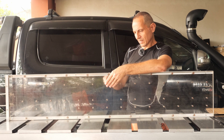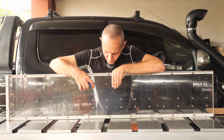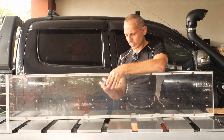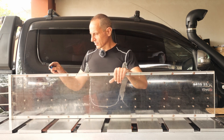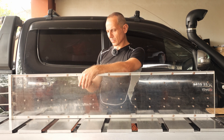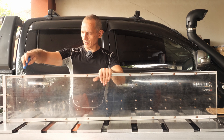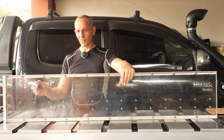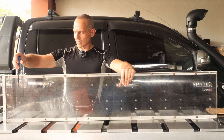I have the allen key here and I can turn the grab screw so it protrudes from the stainless steel insert. The sled is 19 millimeters and I used 12 millimeter grab screws, which allows me to raise each individual leveling grab screw to around nine millimeters maximum. If that's not enough I can resort to shims. The stainless steel makes the whole thing waterproof and time-proof. It also gives me the possibility to attach other jigs or attachments using this matrix of threaded holes, because they are evenly spaced — a modular design.